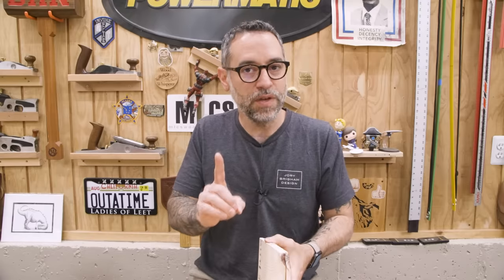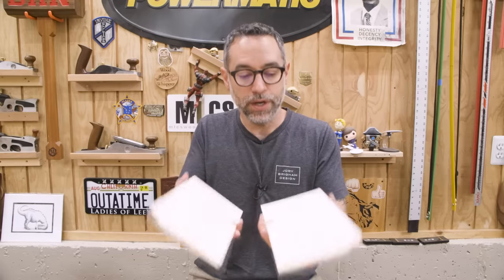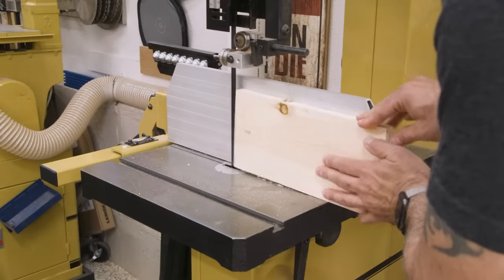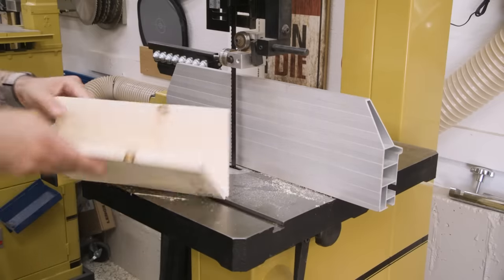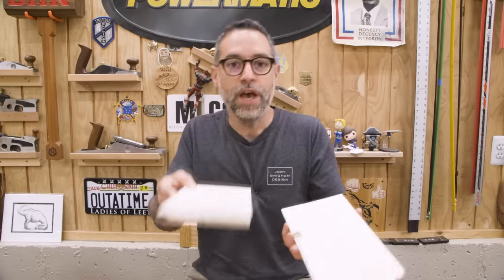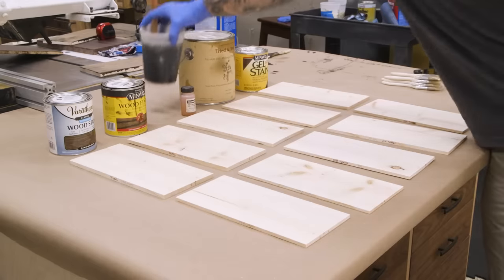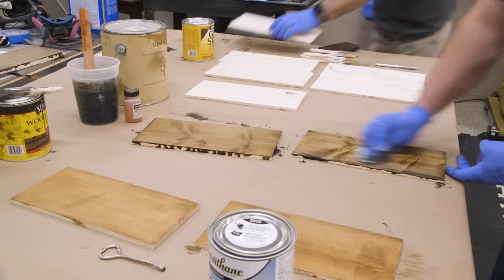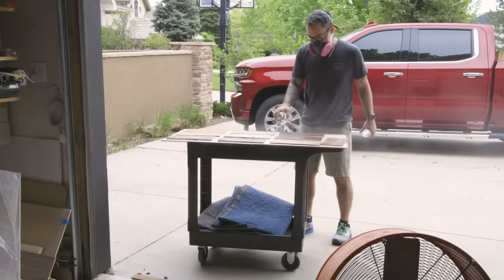Here's the test we're going to run. A cool way to have a fair test is to have a treated and a non-treated board and compare the two. This is derived from a single piece of three-quarter inch stock that we re-sawed in half — when you fold it open, those two surfaces are about as close as we can get to the same board. We'll have one that's treated and one untreated and use various stain products to see what they look like. For the sample boards, we used water-based stain, an oil-based stain, a water-soluble trans-tint dye, a pre-mixed water-based dye, a gel stain, and a clear oil just for fun. To make it easier to see what's actually happening, I sprayed a very light coat of lacquer onto each board.